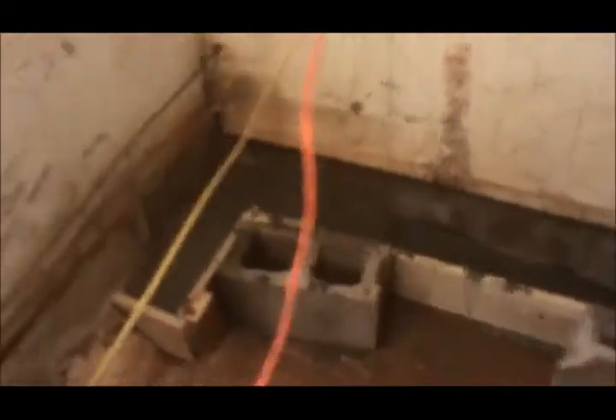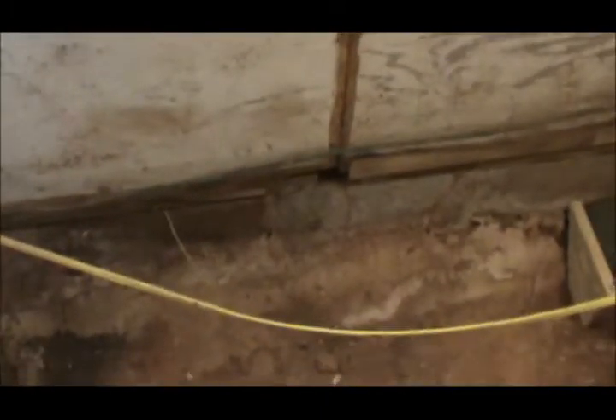As soon as I get it set up I'll get my power strung back up and get this saw moved out of the way back up over here before you hit the door. It's coming along — slowly but surely. You can see I did have some termite damage on this back support here and also over here. It wasn't too bad but it was getting pretty rotted — beetles have gotten into it and everything else. It's been up there forever, so we'll get it cleaned up and these old big cracks foamed and sealed.